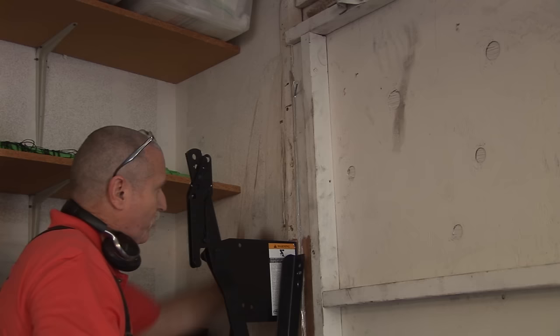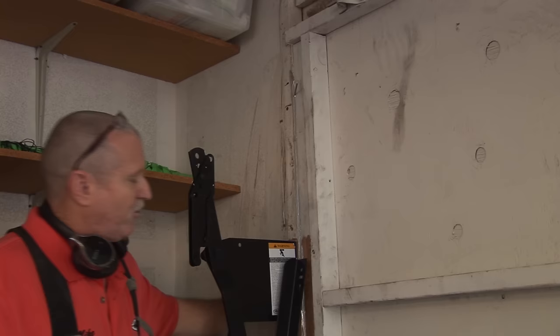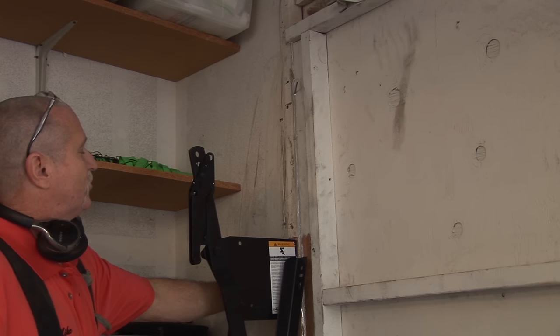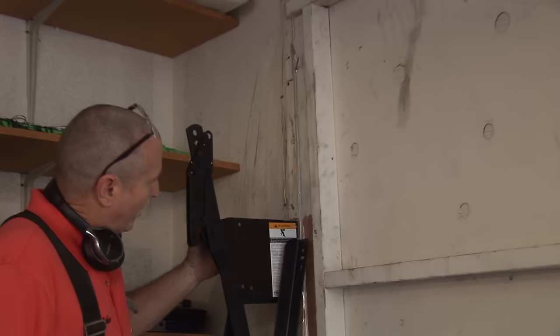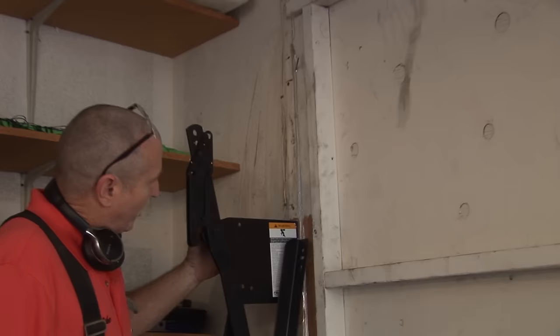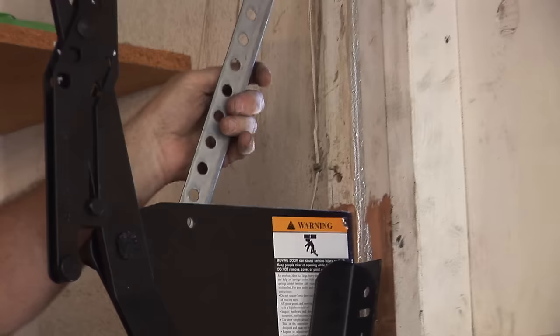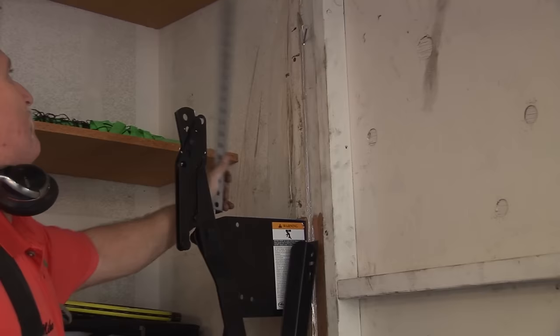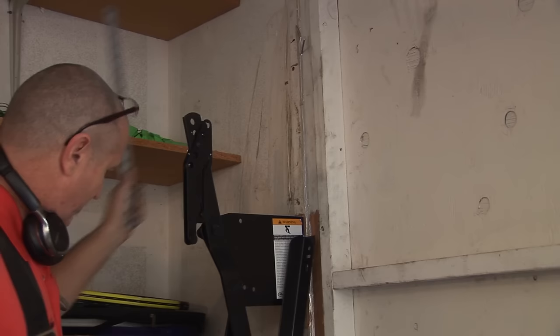We're sitting here looking pretty square, even with the jamb on this side, and mounting it felt pretty solid. With this hardware I've got a spare hole on the back side — use that extra lag since this jamb was off a little bit and had some splitting down near the bottom. Bottom line, they give you this hole up here to brace the hardware with. So we're going to utilize it. Anytime you've got a heavy door you want to utilize that brace. I'll use angle iron — sometimes I use conduit, sometimes angle iron, depends what I've got handy — but any kind of extra brace up near the fresh wood in the jamb is going to be helpful.